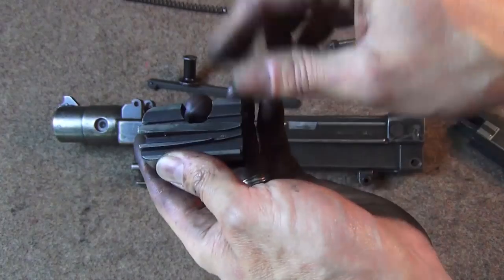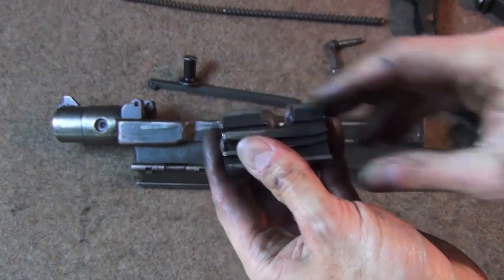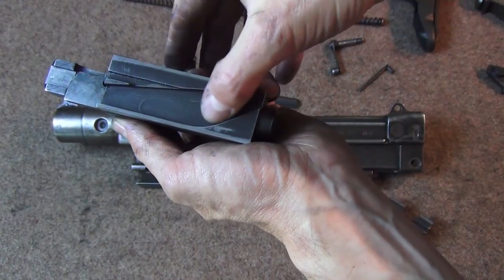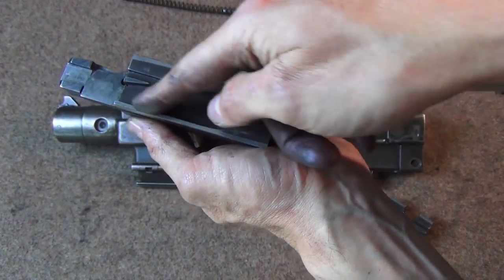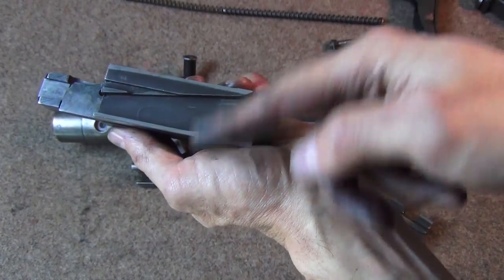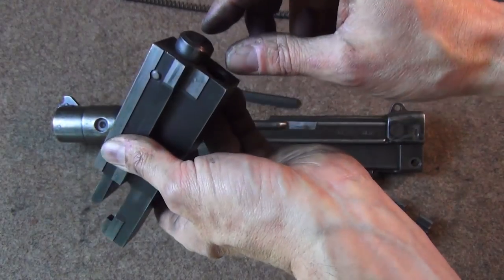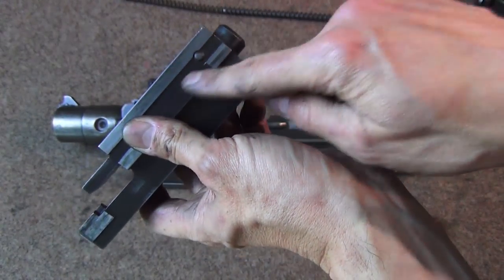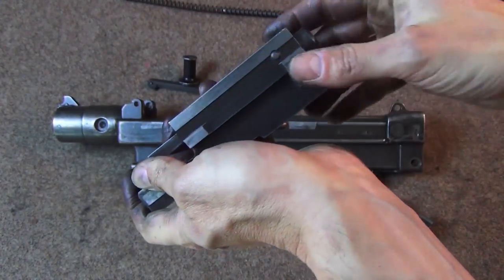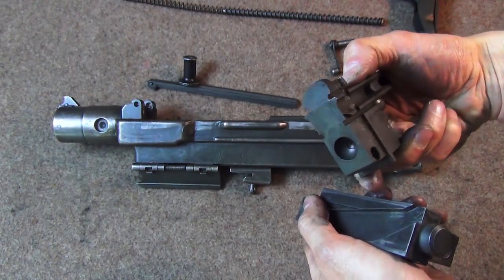Now, ejection is actually made by the underside of the feed tray. And just going quickly back to the main body, we have this surface up here, which is the guide surface for the feed mechanism, for the feed claw. So this is what's causing the arm to go left and right to feed the belt through. And on the back here, we have a buffer. So there's an insanely strong spring in there. You just have to believe me, I really can't push it in myself, but it is in there. That's what the drawings say. So that also slams against the rear block here.